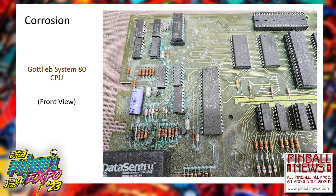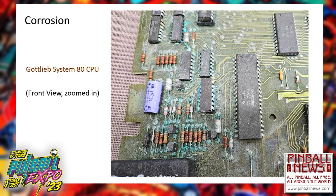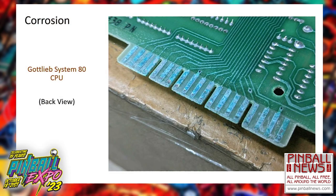Here's another Gottlieb System 80 board. Really, every part to the left of the processor needs to be replaced. When battery corrosion starts working its way up the legs of those chips and resistors, it's not going to just stop there — it'll be inside all these parts. When you start unsoldering these resistors, many of them will just have the legs break off the body. This is the only board in this presentation I have not fixed yet, partly because it needs everything replaced, and partly because when I flipped it over, all the connectors on the back look corroded beyond cleaning.